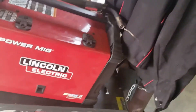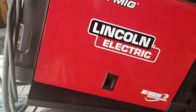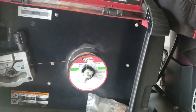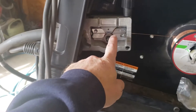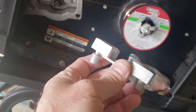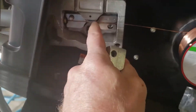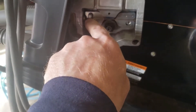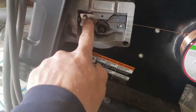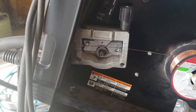I've had it for four or five years now — longer than the three-year warranty, unfortunately. Pretty happy with it overall. The issue I'm having — and I don't know if anybody else has run into this — is with the wire drive. You have this little piece that goes on there and keeps everything sandwiched together so the wire feeds into the torch. This is where you get your birds nesting, and that's the one issue I've had with this thing.